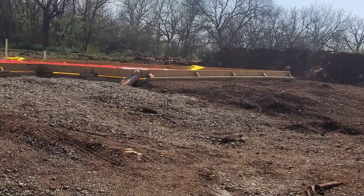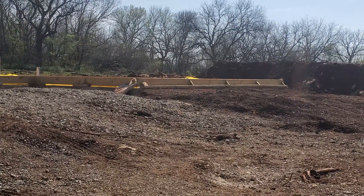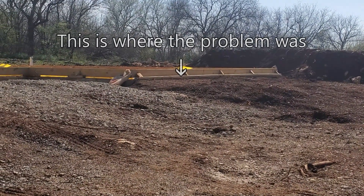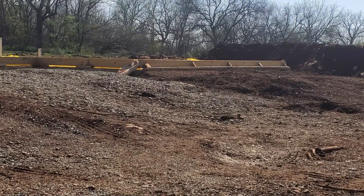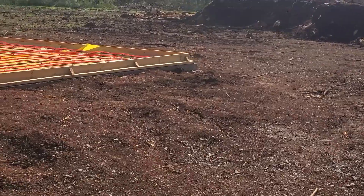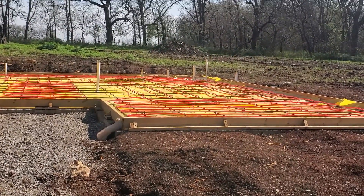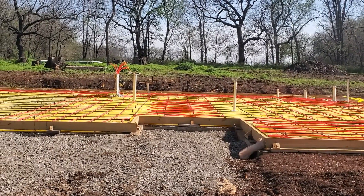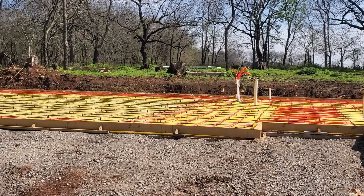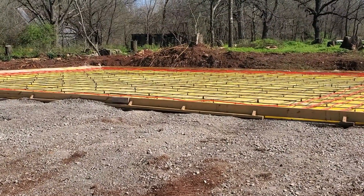So this is what I saw. When you get down low, all the forms should line up and disappear at the same time. What was happening is that the form on the right had a big hump in it — as I came down it was level up here but I could still see the framing off on the left. Now I've got it tied back down and it's right where it should be. Underneath your slab you put a piece of foam right underneath your base plate and that foam will help take care of any minor imperfections — it's called a bug guard or bug screen and it squishes into the gaps left when your slab isn't perfectly straight. So it should still be fine — glad I caught that.